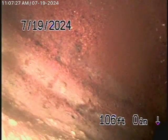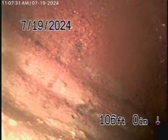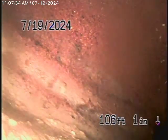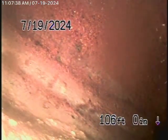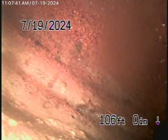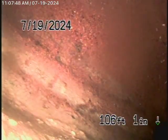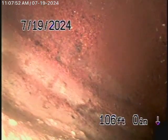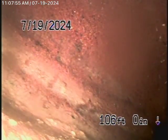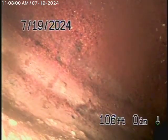We're here at 1484 Scott Avenue in Los Angeles to check the main sewer line. We obviously cannot check every pipe in the house — there's a general inspector and a plumber for that. The house appears to be on a concrete slab, and this inspection is based on my opinion. We're running our camera from this four-inch two-way clean-out, where the pipe exits the house on the right-hand side from the street. We have our camera in the line.